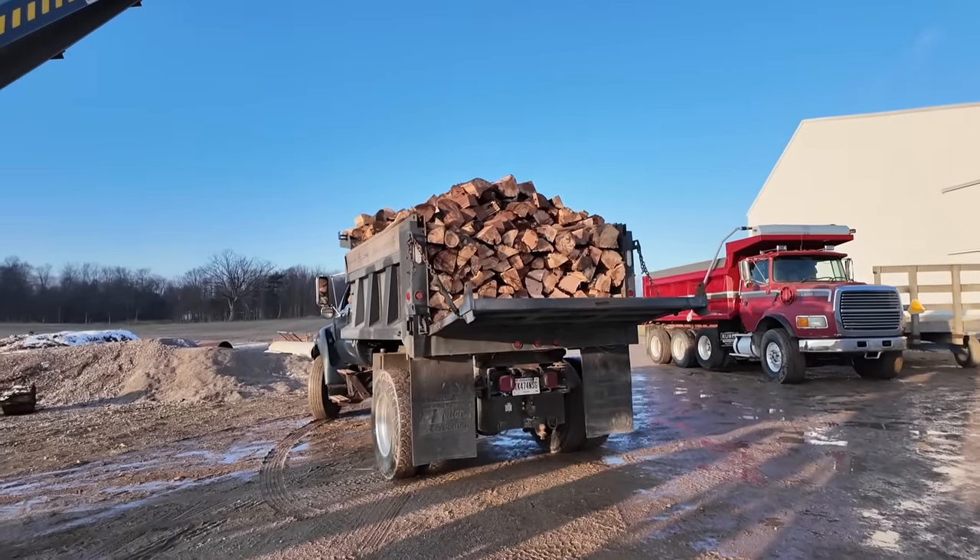The sun came out again. This is actually pretty impressive — if we can use the elevator to dump into this truck, that's going to be pretty cool. Time is 4:40. Another thing I've learned over time to speed up production is to put the big end — the butt end — in this processor first. That way as the log goes up it gets smaller, and then you're not dealing with those big rounds at the very end. That really helps out. We're going to run one more big log.